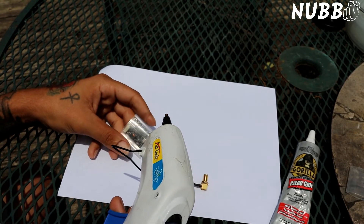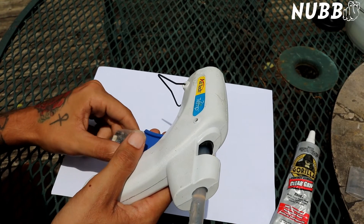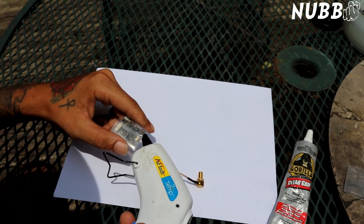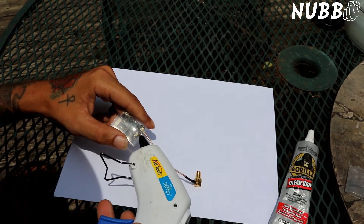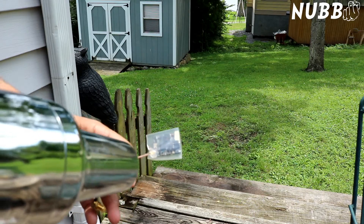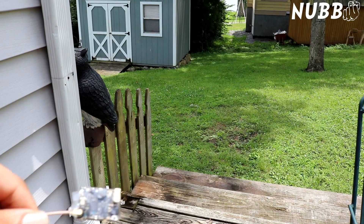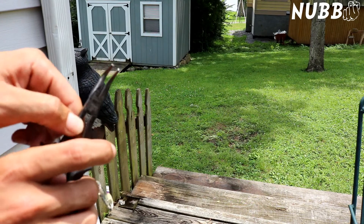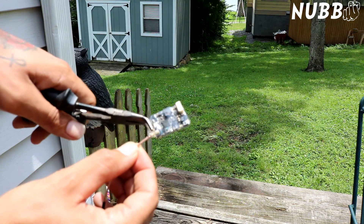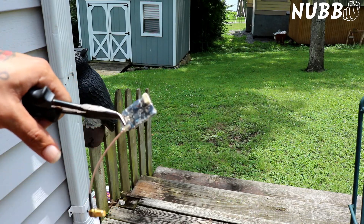I'm going to go ahead and use the hot glue gun. We have to do a little bit of a faster process here, as you want your glue to still be hot when you go to heat shrink it. So I'm going to take my hot glue gun and put it in here right above the connector and just pump in a few squeezes, just enough to surround it. Now we're going to move on over to our heat gun. While your heat shrink is still pretty warm, get out a set of pliers and go ahead and crimp down right here on the end of the heat shrink. Just hold it there for a second — this will give it a good seal around the connector, just a little bit more strength.